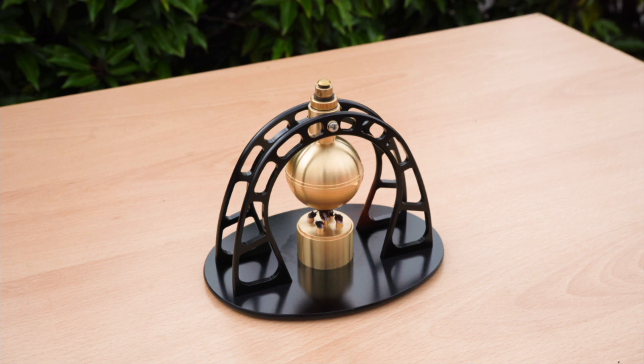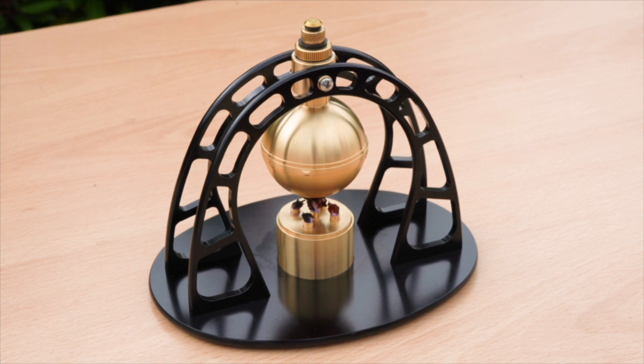We did a little update to it. Normally the ball is just hollow on the inside, but what we did is put a plate at the halfway point. So the water stays at the bottom half, and when it boils, the steam goes to the top half and then comes out through the jets. That stops you getting sprayed by hot water or steam as it's spinning up.